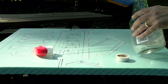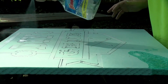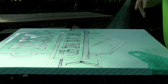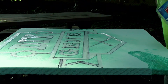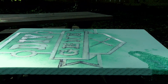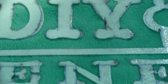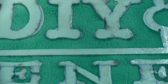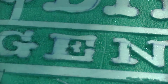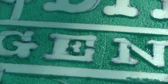Now we're going to go back to, like in the previous video, using straight lacquer thinner, pouring it into a bottle you don't care about — I'm using an old Windex bottle here. Then you start spraying your lacquer thinner on top of your material. Take a look at how quickly this starts to eat into the material; it starts going fairly deep fairly quickly. Take your time, come back, do several coats, and you can kind of judge how deep you want things. It actually is eating the surface and digging down through it, giving a nice almost full eighth-inch depth. You can see where I even had a few overcut marks, but I'm good with this because I want to create a stressed or aged look to the product.